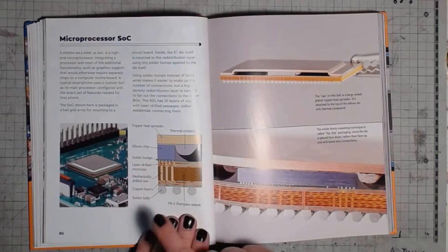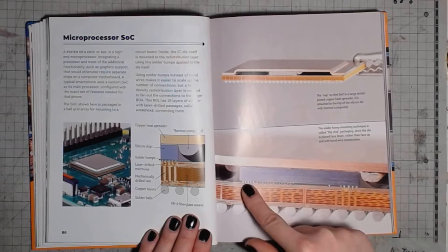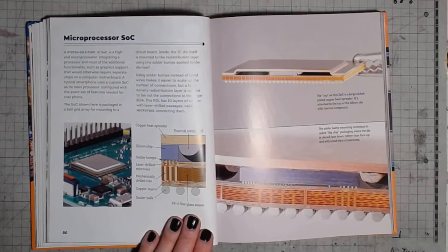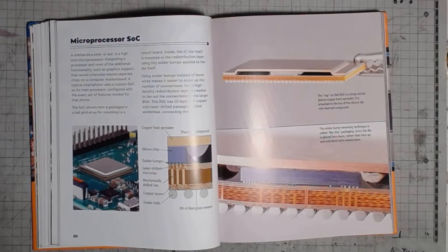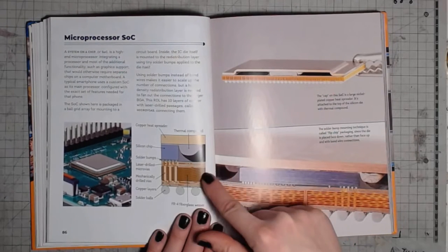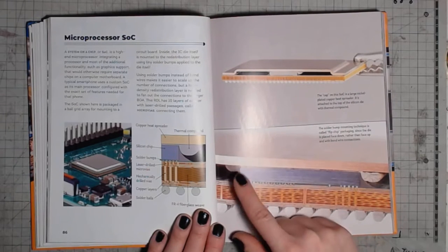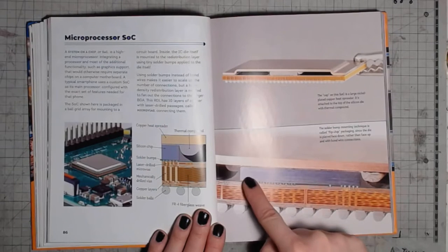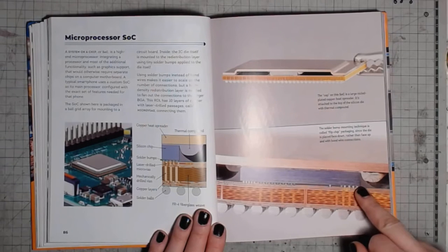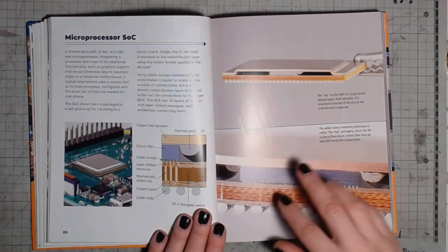It's a system on a chip, more than just one integrated circuit. It's a few of those integrated circuits. This one is part of the Raspberry Pi 3, and this is in fact another printed circuit board called the redistribution layer, and the components, the integrated circuits, are BGA soldered to this redistribution layer.